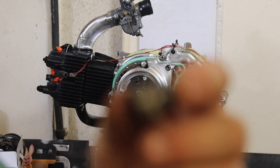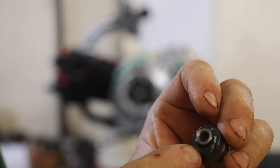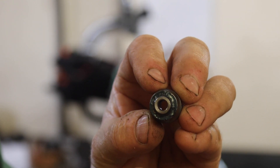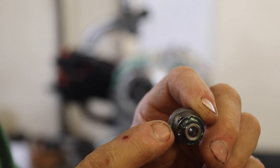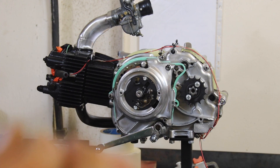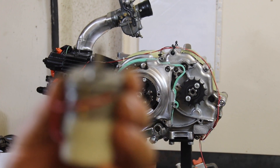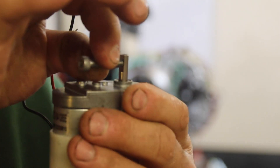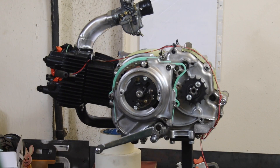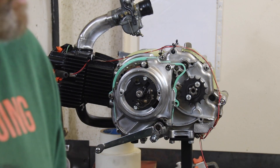The next bit was my socket — that's an M14 six-sided socket. I basically turned down a bit of M12 bar and made it a press fit in the 3/8 square drive bit, pressed it in and TIG welded it. My hope was that leaving it to cool naturally it would anneal the socket slightly — because obviously these are chrome-vanadium — and I needed to drill and tap an M5 hole to put a grub screw in, which will press on the flat on that shaft. The M5 is the same width as that flat, so I'm hoping that will work. If this motor proves successful I'll order a spare, because it's Chinese so it won't last very long, and I don't want to have to remake all these bits for another motor.